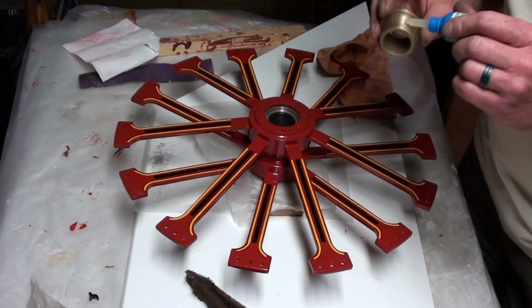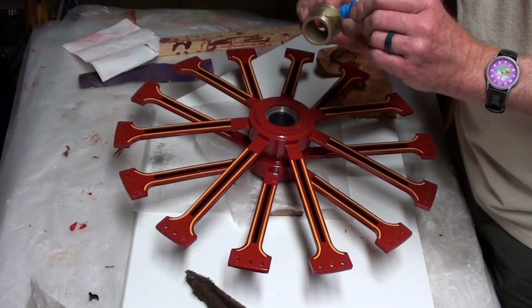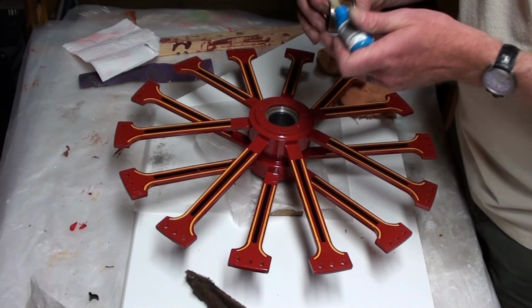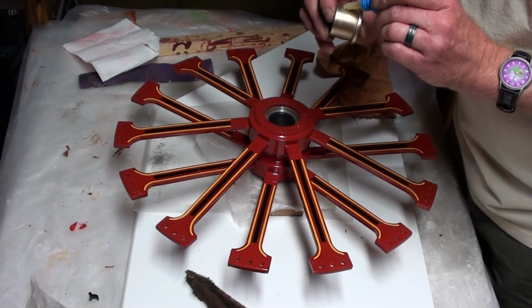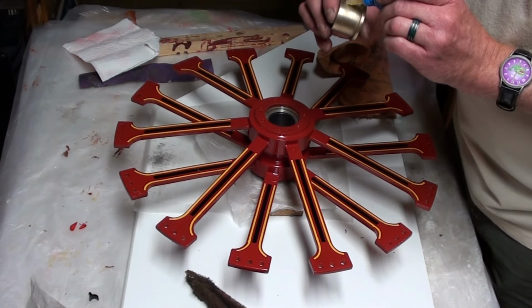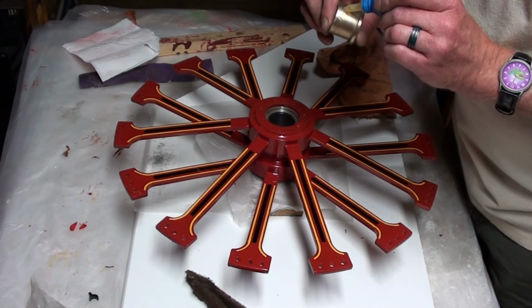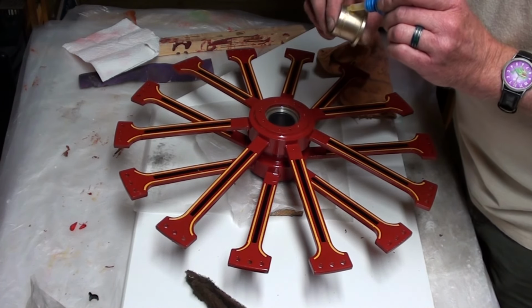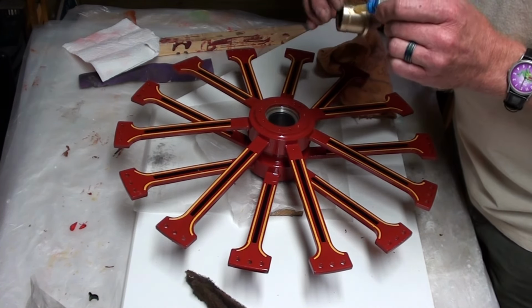Before reassembling the wheel, the bronze bushings were set in place with bushing grade adhesive included in the kit. The hub was carefully cleaned and prepped to remove any paint where the bearings fit. A few edges had to be relieved slightly with sandpaper and a touch of filing to get a good fit. Even so, the bearings fit snugly in the hub and required some assistance from a hammer and a block of wood to set fully in place.